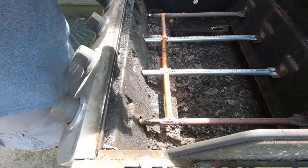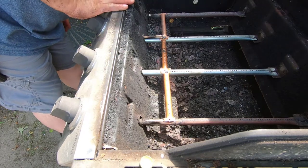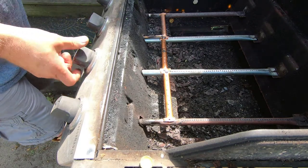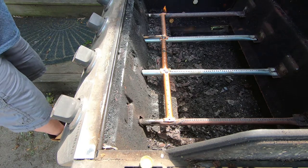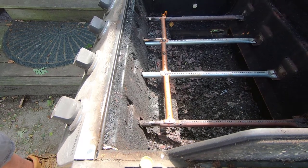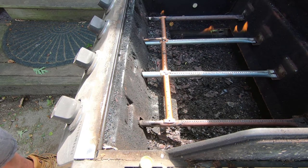You'll notice I didn't put the screws into the existing burners on the ends. That's because the steel used for that was a little bit harder — I was afraid I'd have to put too much pressure and break the tube and have to make two new ones, so I didn't put the two end screws in. Now I'll do a quick test to make sure they all light. You can see how long it took for the other burners to light — that's because I drilled those holes in the top and I'll have to fix that.